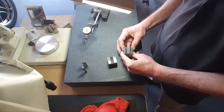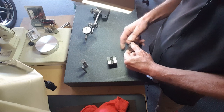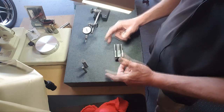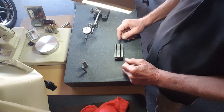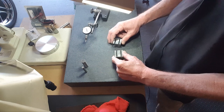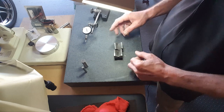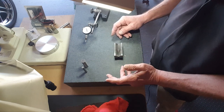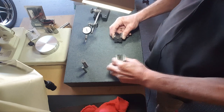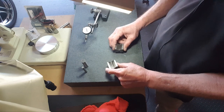I'm just going to be rambling on here. These v-blocks are Starrett, and I suspect they're a matched pair because they're serialized - there's a serial number there, 364, and same on this one, 364. I'm assuming they're a matched pair. I've run the indicator over surfaces and one of them's angled some which way. But why would you want a matched pair? The only time you'd want a matched pair is if you're trying to support something long in the groove.